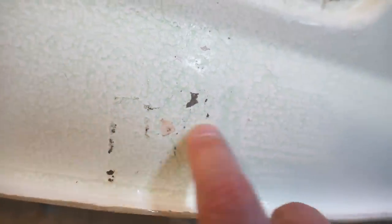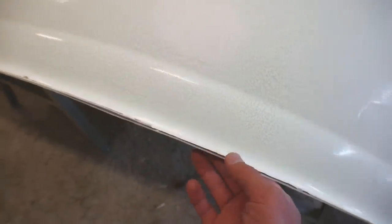There are a couple of areas where the gel coat stayed with the mold — I'm not sure why — but I'll have to smooth and touch that up. The rain gutter here was the most problematic; you can see the gel coat separated from some of that. But when it gets trimmed, it gets trimmed really low down there so you won't actually see any of this. That was definitely the most problematic part — popping out the little rain gutter. I wasn't even 100% sure I wanted the rain gutter because that's going to be a real fragile part, but I'll leave it on, trim it up, and see how it looks.